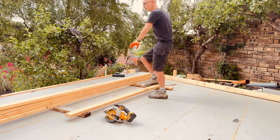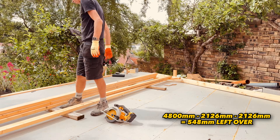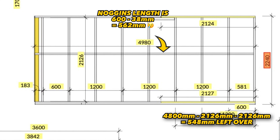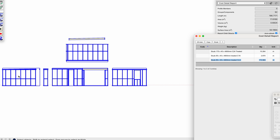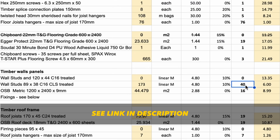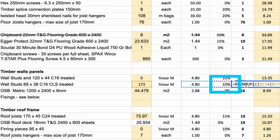Preparation is more important than the actual cutting. I make a pile of timbers — each is 4.8 meters, so I get two lengths of 2126 millimeter studs per standard length, with around 540 millimeters left over. I try to use offcuts but they're usually too small for noggings. This is why you always allow for wastage when calculating quantities. I tend to work with five to ten percent wastage — but the less experienced you are, increase that number. I'll leave a link to my ordering template in the description.